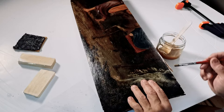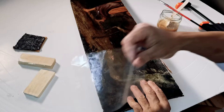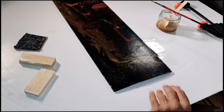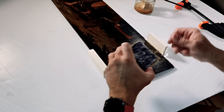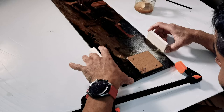It's important that every single part of the wood takes a little bit of this glue. And in order to protect the wooden board and prevent the glue from sticking to the table, I will use a little bit of mylar film. Also, those two blocks that will hold it together are also protected with a little bit of mylar. This little square was supposed to prevent the clamp from being in direct contact with the painted part.